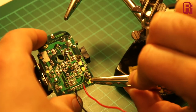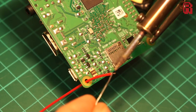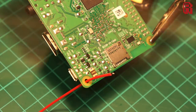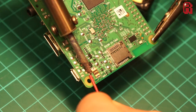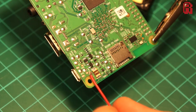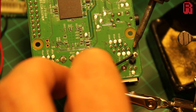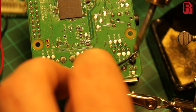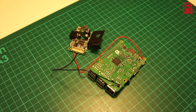An alternative way of doing this would be to get some cable connectors that you put straight onto the pins, but you'd still need to solder at the Pi end. At the Pi, with the 5 volt cable we're going to touch some solder on and solder that onto PP1, being very careful not to let the solder bleed and create a connection with any components we don't want to touch. Gently touched on, then just a light tug to make sure it's secure. Also make sure you've got clearance for your screw to mount the board. Turning the board around, we attach the other end of the ground cable to one of the ground points that the USB ports use.